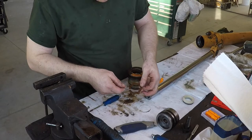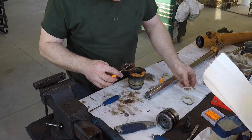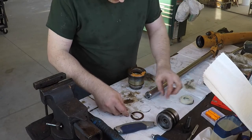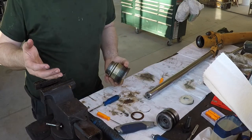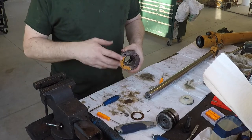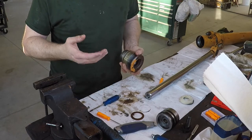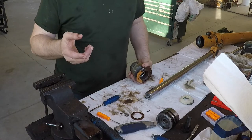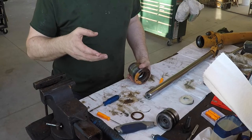Okay, that's the way it came out. It's this guy right here. Okay, gap side of the lip down. Okay, I'm gonna go wash this again. The reason I like to use real hot water, in addition to dissolving the oil good, is the part gets hot, and then when you blow it out with your air hose, it doesn't take very long, and any surface water that's left there just evaporates, and the parts dry almost right away. I do this on automotive parts too. If you're cleaning up brake parts, particularly, those clean up real nice in the sink with dish soap.